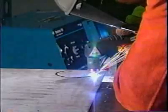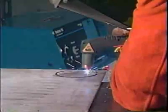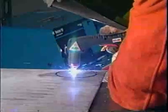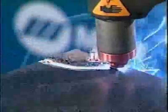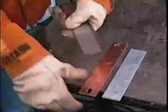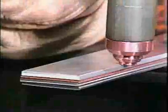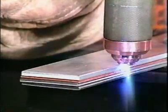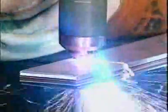With a plasma cutting power source, a plasma torch, adequate compressed air, and electrical power, we can rapidly and precisely cut or pierce any electrically conductive material without preheating and with little or no heat-affected zone. Yes, aluminum, stainless steel, brass, copper, and even titanium are included. Or should the need ever arise, all simultaneously? And as you can see, plasma cutting provides the solution to cutting stacked material.